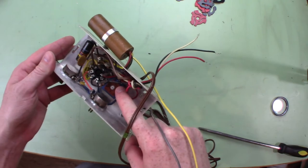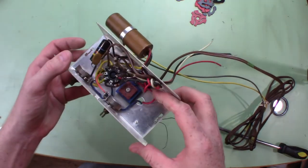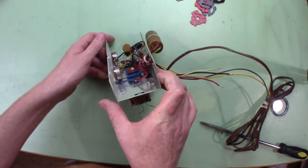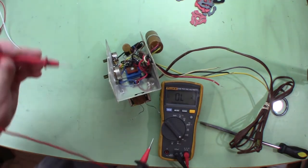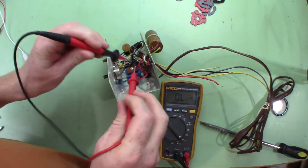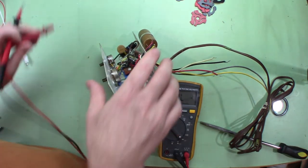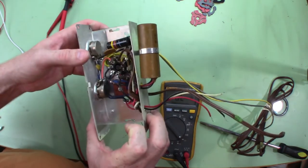This has a picture of a diode on it — an interesting looking diode. I'm not sure what it goes to, but let me put a meter on it and see if it gives us a diode reading. I'm getting nothing in either direction. I'd say that's either not a diode or it's not working, though it definitely looks like a diode symbol — except it's got an 'S' for one of the legs.